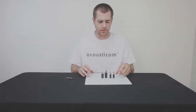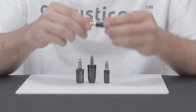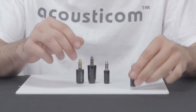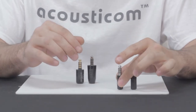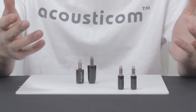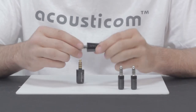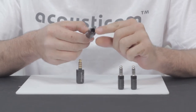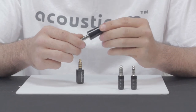I'm going to talk a little bit about the different connectors in front of you right now. The TP120 is the commercial version U174. The TP101 is the military version of the U174, and it's marked with a slash U — that's how you know it's a military connector. This connector is a little bit thicker; it's for a thicker cable. It's military grade — it's the U93A slash U.